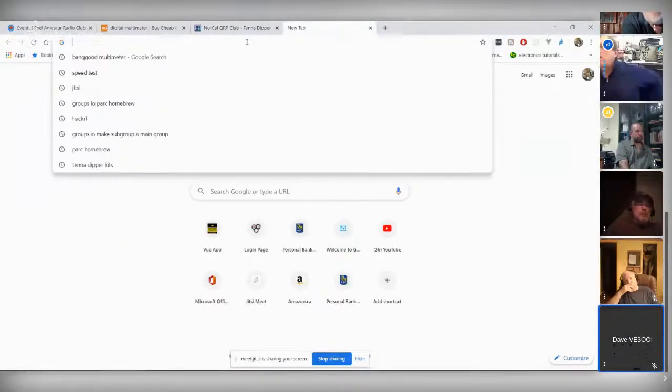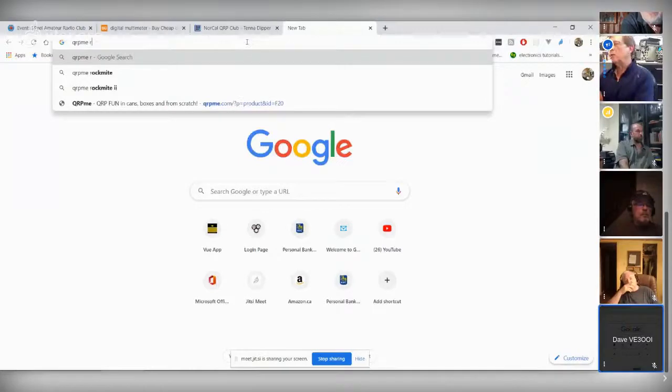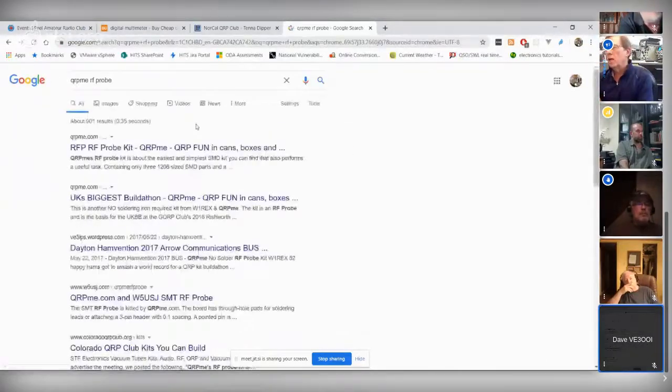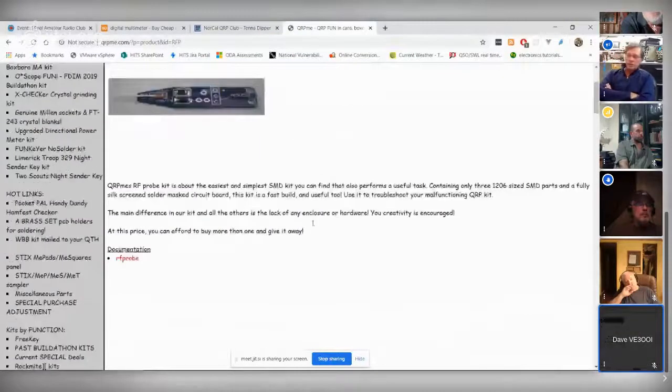Well, actually, we use the 8307 chip in our SNA. And that's what I'm using in the upgrades for the signal generator, the SIGGEN. Part of it is for RF sensing, using an 8307 chip to do that. And you're right, it's a very simple, easy project to build. The 8307 chip is still available in a DIP 8 if you don't want to do surface mount.